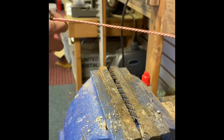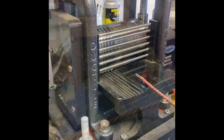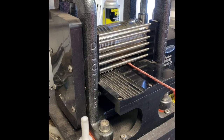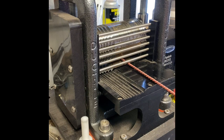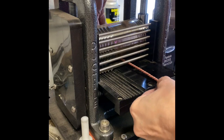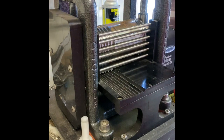We're going to take that and run it through the rolling mill. I'm not putting the wheels too close together — there's where it slips through — and I want to back off about a quarter of a turn. That's all I'm going to do at this point and see if I like it. If not, we'll run it through again with an additional turn on the rollers. I just want to see what I get, because if I do too much to start with I can't go backwards.